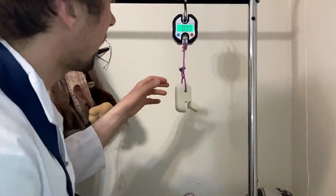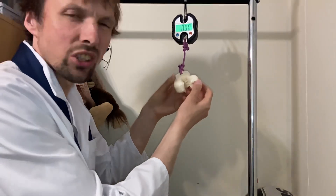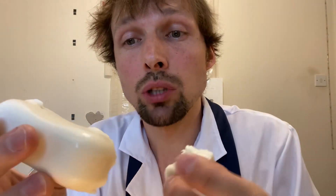Okay so this is what happened — it kind of broke and opened up, so it reached nine and then this is what happened. So it took nine kilograms for this one to come apart, and then this one I pulled by hand and it took 12 kilograms. So it was actually very close to the 10 kilograms that I originally was guessing — pretty close.